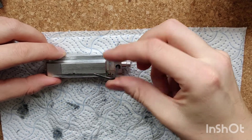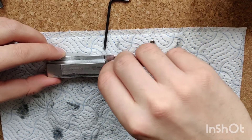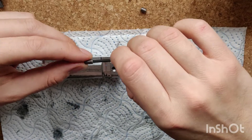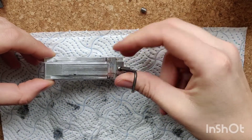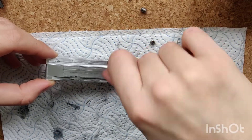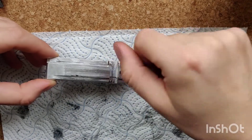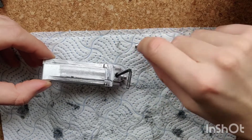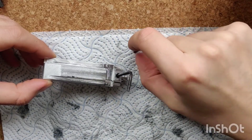So if you're using the solid state bolt very close to minimum power, then you want to be installing the 8mm grub instead — and I think we'll be shipping them with the 8mm installed. I'm going to wind that all the way down. The adjustment is exactly the same; when I talk about number of turns, it's number of turns from minimum, so the actual length of screw doesn't matter quite so much. But I'll show you why we include the shorter one as well in a second.